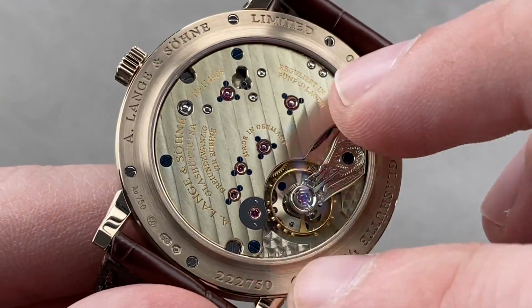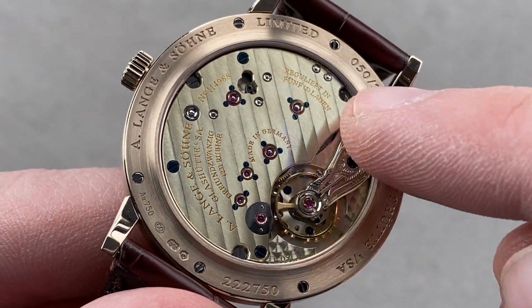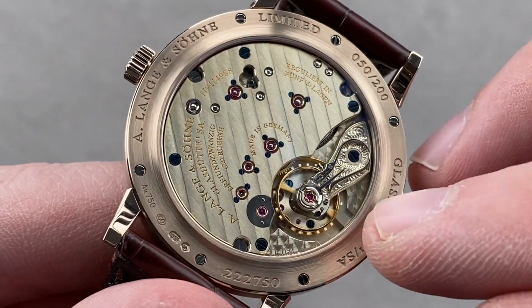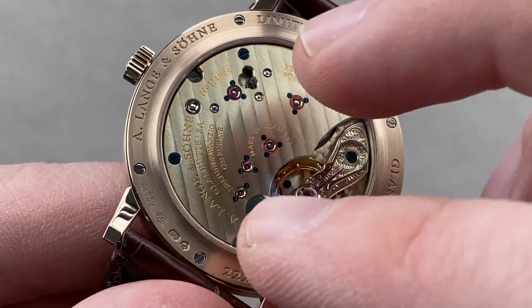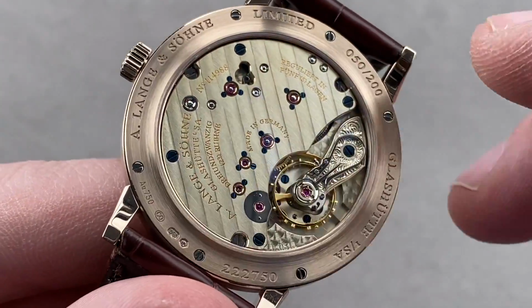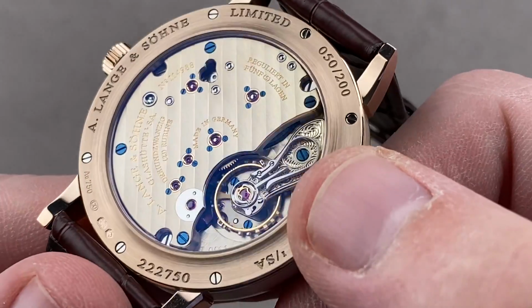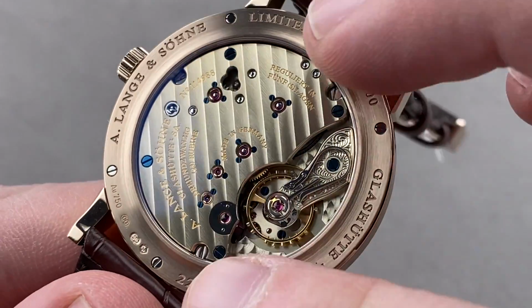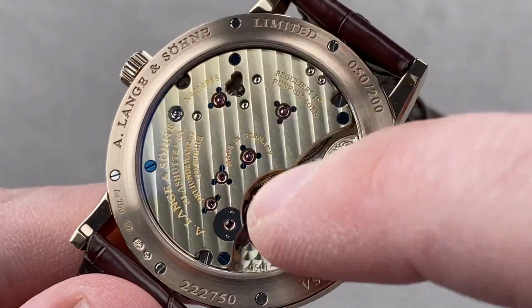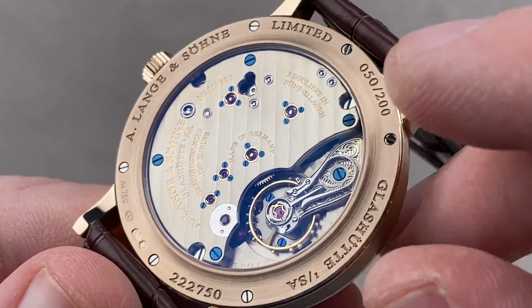Now, the finishing. You get that German silver metal that gives it the golden hue. It's nickel, copper, and zinc, with the copper responsible for the golden as opposed to silvered hue you would see on a Swiss watch that's rhodium plated. This is uncoated, and you see that copper mixed in, giving it the richness and the warmth. We have a freehand engraved balance cock with a black polished set of case clamp screws, locating pegs that help to locate the 3/4 bridge, the cover for the escape wheel, and then a black polished swan's neck regulator.